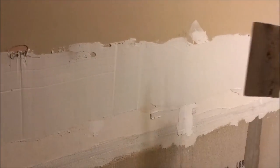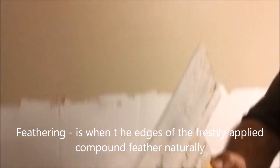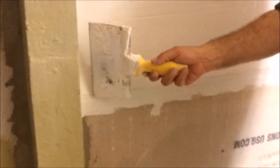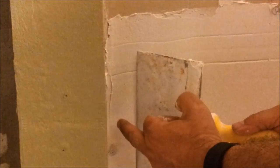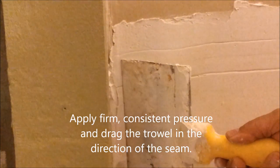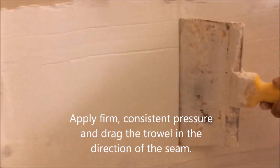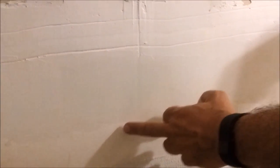Now we've finished smoothing it around this gap — it's 8 inches. What I'm about to do now is called feathering. I've cleaned this knife very carefully, and I'm putting the knife here on the sheetrock. What I want to do is really level or flush this compound with the sheetrock, applying power at 45 degrees. The edge here is really flat with the sheetrock — that's a very important thing. I can continue on this second side of the knife.